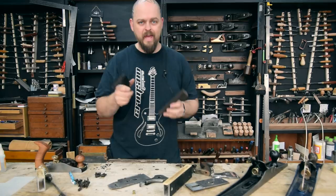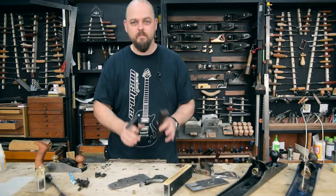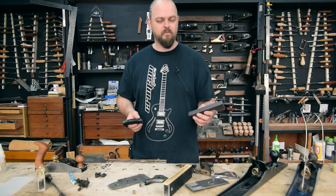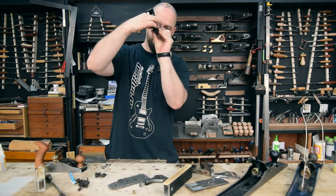I see repaired totes where, I mean, these are woodworking tools. They're being used by people who know how to use wood, and nine times out of ten, when I see a repaired one of these, they have not bothered to flatten either of the sides, and they whack it together and they fill it with Cascamite or epoxy or something, and it's terrible work. I don't understand that. Make sure you've got a good flat joint that will be nice and positive. In fact, I've got a slight rock on this, so I need to sort that out.